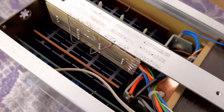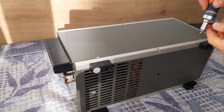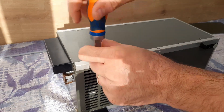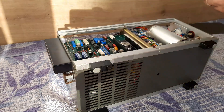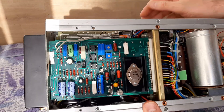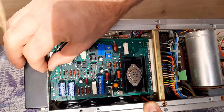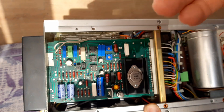Four power transistors and four heat sinks. Let's take also this cover out to see the main circuit board. I put the unit on its side and will take a cross screwdriver to take out these screws. Be careful because two of them have washers for better grounding of the board. Here you can see the construction — it's really nice. You have the driver transistor and the IC controller ICs. This board is fixed here on this connection; you remove these two pins and the board comes out.